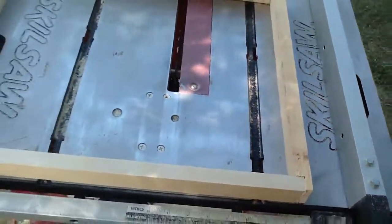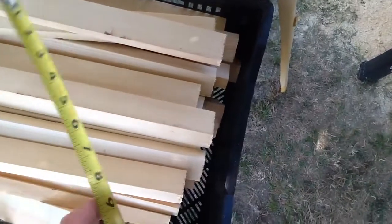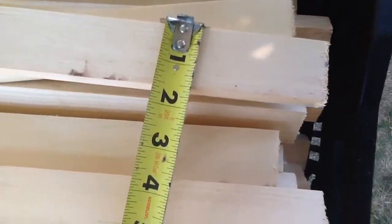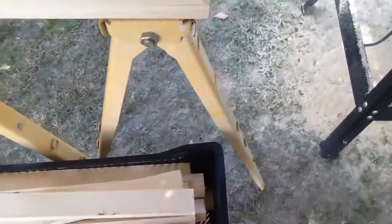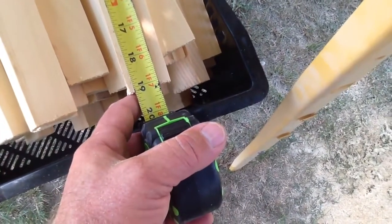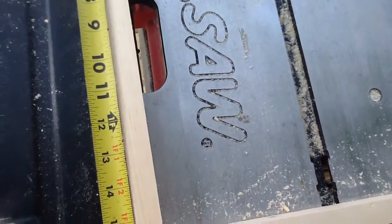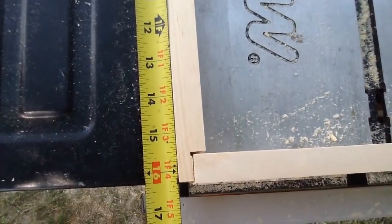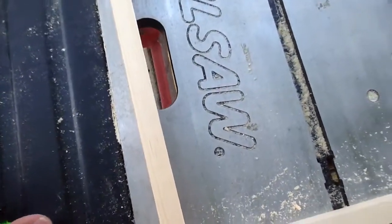Some people don't know what I mean by spacers. Pretend that's glued and stapled together — how thick is that? We said inch and a half, about inch and a half. So that means my side panels are 19 and an eighth. The end panels are 16 and a quarter wide. That's how we're cutting our boxes.